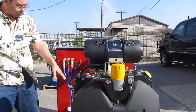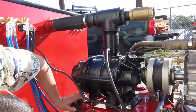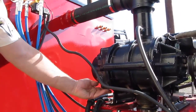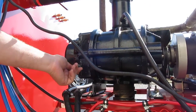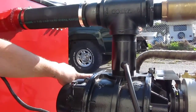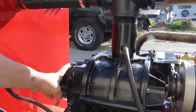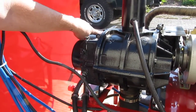This is your blower. To change the blower oil, you have a plug right here — you undo that plug, capture the oil. And then to refill it, you put the plug back in, you open this one up, you open this up here and add your oil to it until it starts to come out here, and then you close that and put your cap back on.